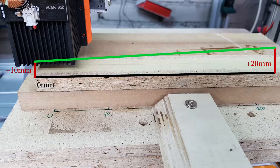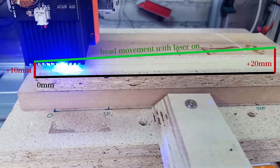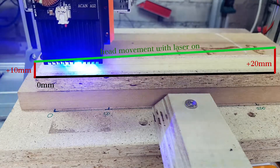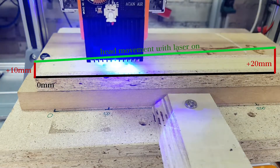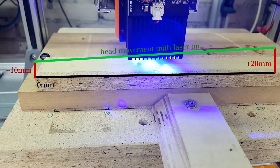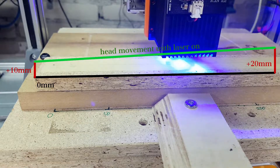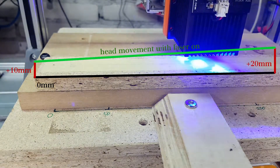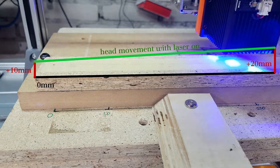Next step is to raise the laser to 10mm distance from the surface — this you should do manually — and then run the gcode that will move the laser 200mm along the X-axis while simultaneously raising the Z-axis by 10mm. We have to set the laser power as low as possible so it will not burn when it's out of focus. The gcode will make a small dot at the start and at the end, and there should be burn lines somewhere in between. If there is no line, check that the laser passes the focus distance and increase its power. If the line is too long or the whole 20cm is burned, decrease the laser power in the gcode.